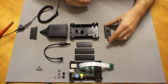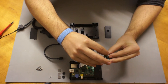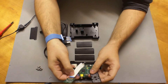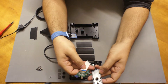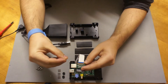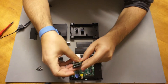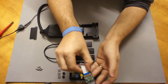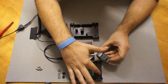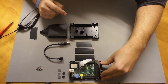The next thing you want to do is attach the camera to the camera plate. Get your O-ring and place it over the camera — it should fit on fairly easily. Then connect that to the camera panel. Orientation wise, the ribbon cable goes down the long part of the camera panel. Put them into position, hold it in place with your fingers, then get your click rivets and push them into all three holes. These will hold the camera in position quite firmly. The two extrusions on the cover line up with two of the click rivets and push the camera board firmly onto the camera panel.